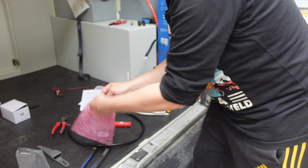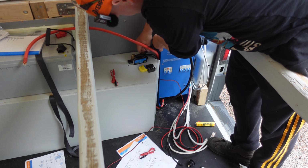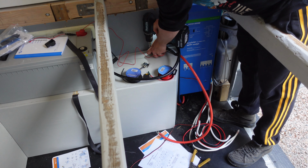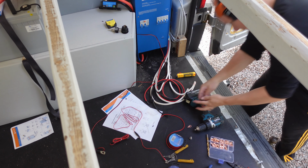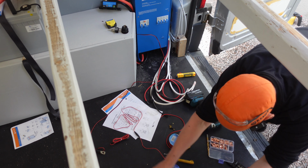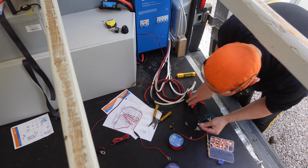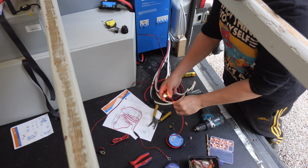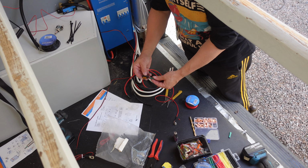This says two battery minus. So, all right, now we have 5 amps fuse. Should be enough for now. We can switch to a bigger one. First, we want to create cable from battery to 12 volt system. So to the fuse. This is that one. So this cable will be going to battery and the other side will be going to temporary fuse box.